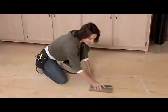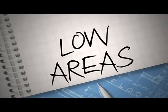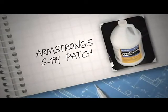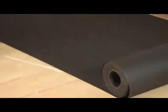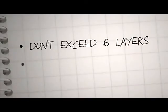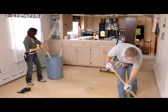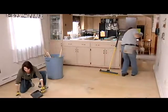If the subfloor is not flat, you'll need to sand or plane the high areas or fix the low areas. You can fix low spots in a couple of ways — it all depends on how you're going to install your floor. If you're going to glue down your hardwood floor, use Armstrong's S194 patch, underlayment and embossing leveler to fill in those low spots. If you're going to use staples or nails, you'll need to put down number 15 builder's felt over the low spots — don't exceed six layers. If you have severe low spots, you can bring the level up with shims or plywood. You're just about ready to install your hardwood floor. Last thing: do a final broom sweep or vacuum.